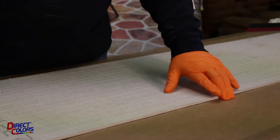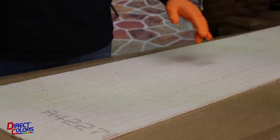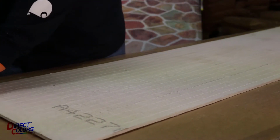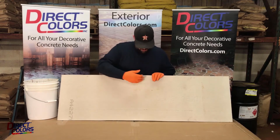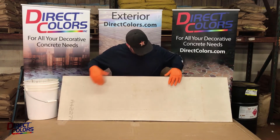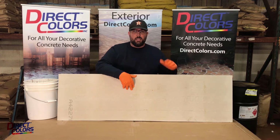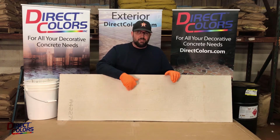What we're going to work on today, as I'd mentioned, is a piece of hardy backer board. The principles are the same, whether you're applying direct to concrete or a backer board. I'm going to talk to you a little bit about this piece of backer board real quick. You'll notice, if you've worked with this before, you already know, that it's gridded on one side. It has grooves. They've got their branding where it'll say hardy backer board on it in different places. I don't like to overlay this side. The opposite side, the back side, has plenty of texture. Your overlay will stick to it just fine, and you don't have to worry about these little grid lines showing up in your finish.